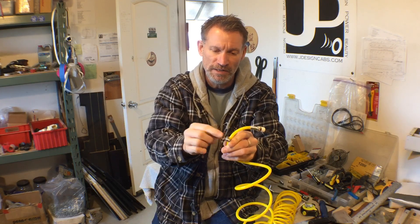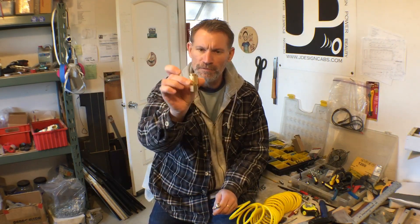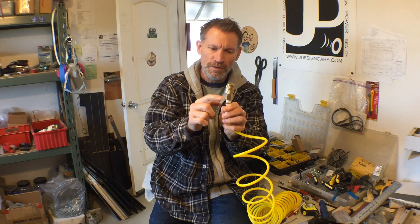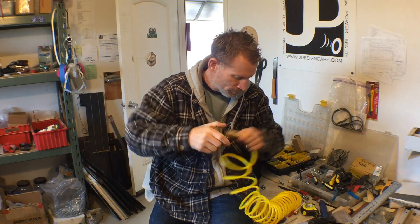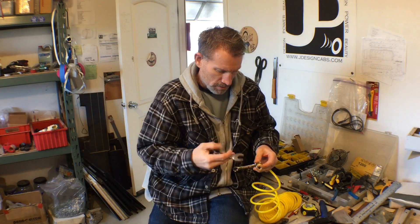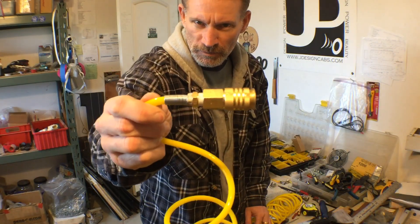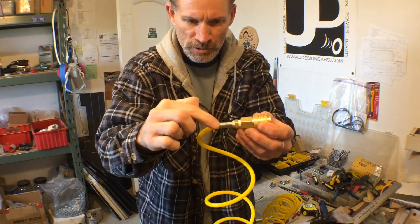If you feel the need for extra security, go ahead and put your hose clamp on and tighten it down. Now we can take our female standard connection and thread that on here. We've already pre-coated it with Teflon seal — just a couple of winds around the threads will do. Give this a good snug. Make sure that's good and snug. Now we can test for leaks. Nice and tidy connection there — no air leaks around the seals or at the hose connection.